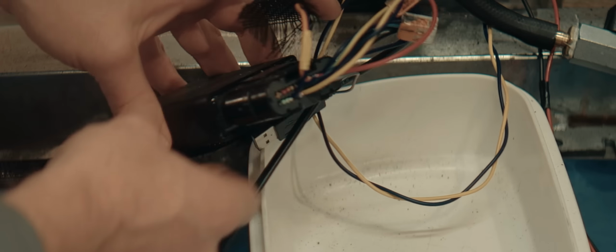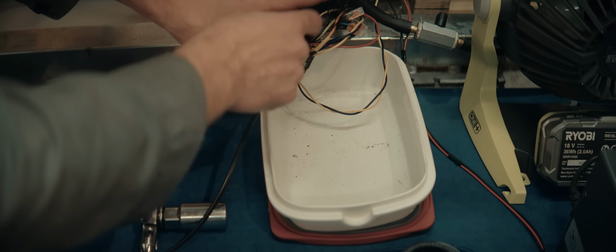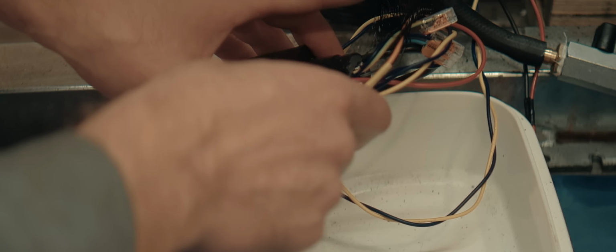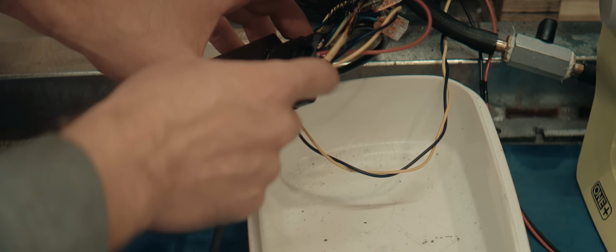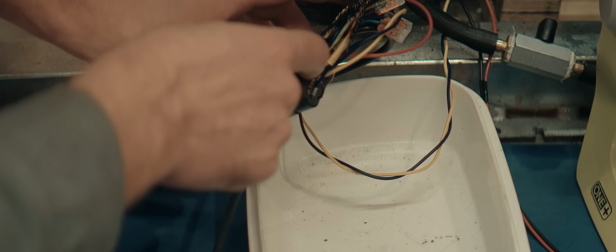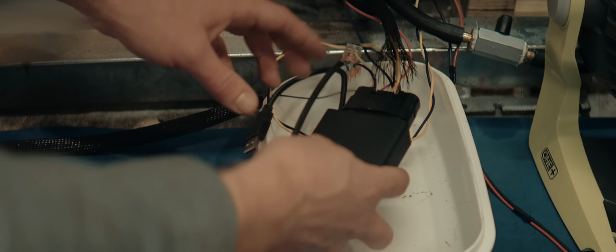There's one problem though. While fighting electromagnetic interference, I cut all these wires short. I actually mentioned I would regret that because I knew I would need some of them. And now's that time. I haven't got new pins for this connector. We'll have to de-pin, solder on new wires to the little wire stubs, re-pin it with those. Not a huge problem though.